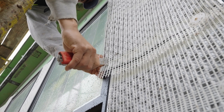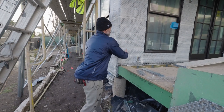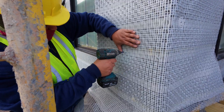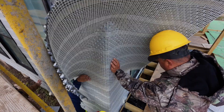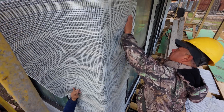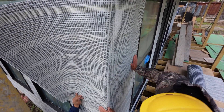I brought you a corner because I wanted to point out a specific detail. Rather than have this material meet right here with a seam, we strategically wrap the corner in one solid piece, which is going to be beneficial for keeping bulk water out of the corner and really aid in making this wall more robust and long-lasting.